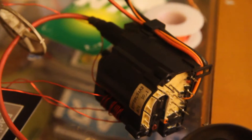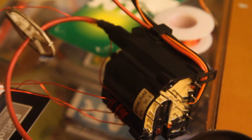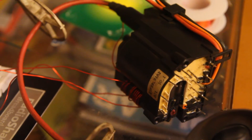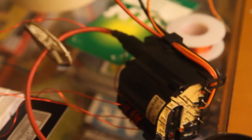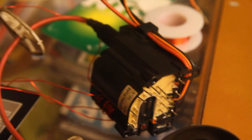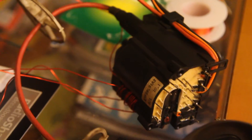There's a reason these things hold a charge. Inside most DC flybacks — and this is a DC flyback — there's a diode to rectify the high voltage coming out, so it's direct current. But also inside is a voltage multiplier. The voltage multiplier has, among other things, specifically diodes and a series of capacitors — basically a series of diodes and capacitors lined up to multiply the voltage. It charges in parallel and discharges in series, which allows it to increase the voltage, multiplying it approximately by two, though losses affect that.